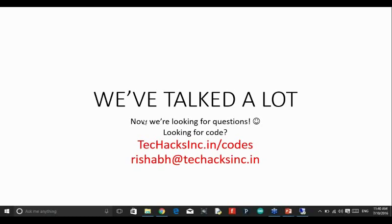Sudhir is asking where we'll put the codes to run the device. You must have used Arduino boards or Python. You could visit techhacksinc.in/codes, and we have uploaded our Python library and our Arduino library there. So you could test it out. Basically, you put your serial number in that code, and it will make HTTP requests and send the sensor data to the platform, and it will also be used to control analog actuators and digital actuators.